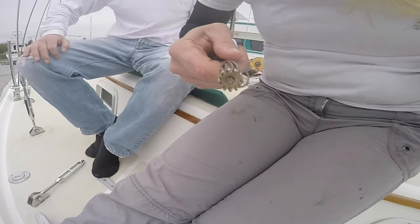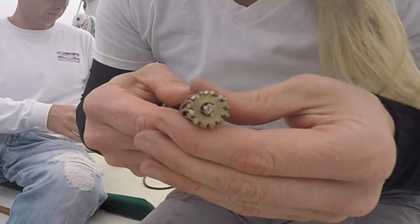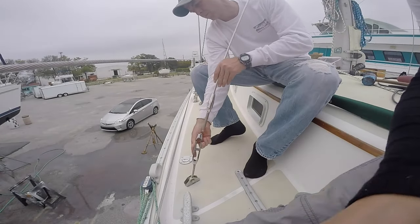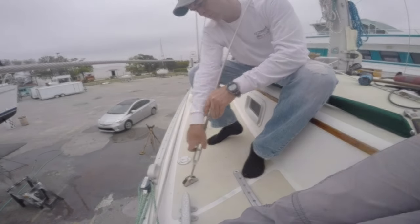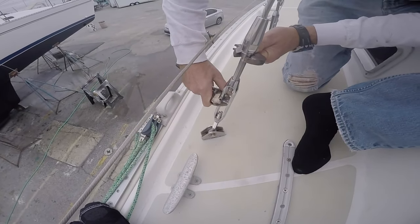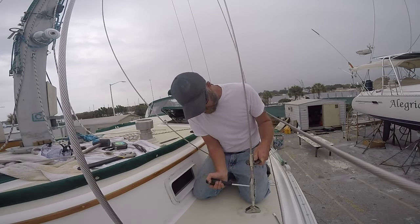Once that was complete, we then screwed on the Hi-Mod attachment that threaded into the turnbuckle. Once it was screwed into the turnbuckle, the shroud was then securely connected to the deck, and we used the turnbuckle to tighten. Occasionally, this process had to be repeated if we cut the shroud too long and had too much thread down in the turnbuckle, but it was better than the alternative.